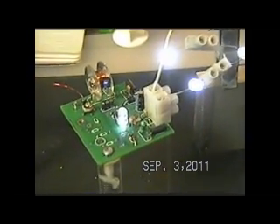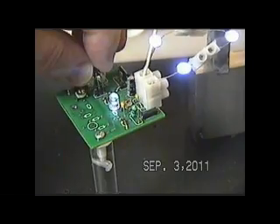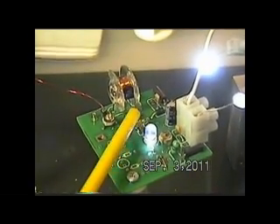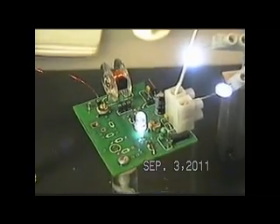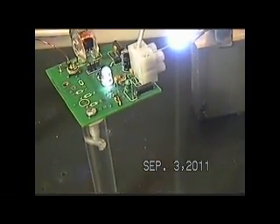With the bobbin coil, the secret — or part of the secret — to make it work is: let me pull this transistor out. When you put the transistor back in the socket, you want to bend the emitter lead back, or either forward, so it does not go into the socket. Let me go ahead and plug it back in here. What I have is the collector-base junction in use, and I'm not using the emitter junction. I'm not using the emitter of the transistor — it's just sitting over here on the back. So you want to be sure you don't use the emitter connection. You're only going to be using the collector-base junction. That pretty much, as you see when I plugged it in and took it back out, said it would work or not work.